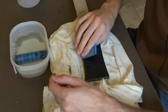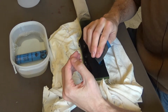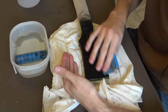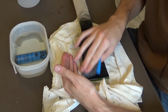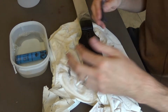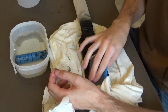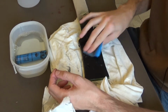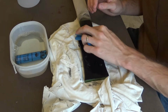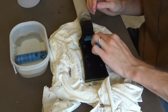I tried to overlap the tape so that the black would kind of run over the edge slightly into the brown, onto the top of the brown, rather than making sure they left a gap. And then the headstock was completely uncovered anyway, so any brown would have moved over. Hopefully the two have overlapped, and I think the idea was that I favoured the black over the brown on the sides, so it's got a slightly stronger finish. Where you knock it, it's got a slightly stronger and thicker finish, where you're most likely to hammer the guitar into stuff in the course of using it.